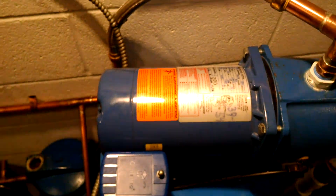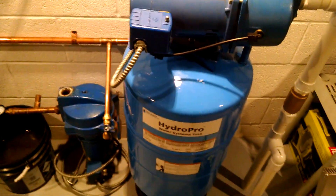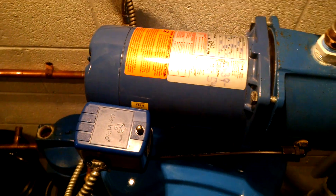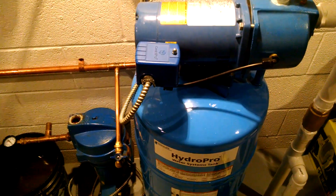Because I have three tanks, I don't mind having only a 15 PSI split. I don't mind less capacity per tank due to the higher cut-on and cut-off pressures. Basically you're talking about 15 gallons of total capacity across these three tanks, so that's perfectly fine.